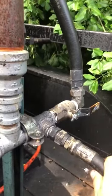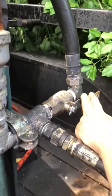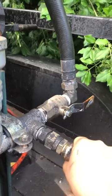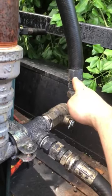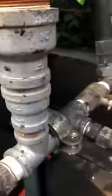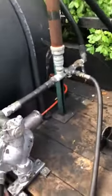That goes to a T. This is the hose that I dispense from — got a ball valve here, and that separates the dispensing side to put it on the ground, and the recirculation line back to the tank. With it open, that recirculates right back into the tank. If I close it, then I pump out of the hose. Let me know if you got any other questions, happy to help, take care.